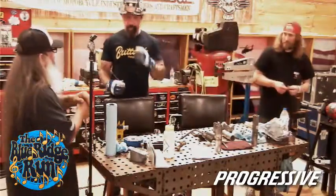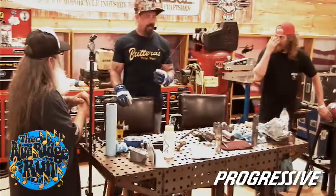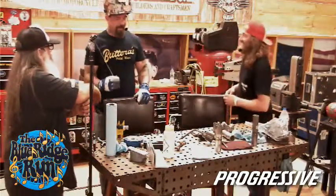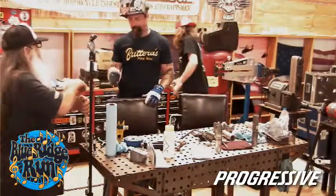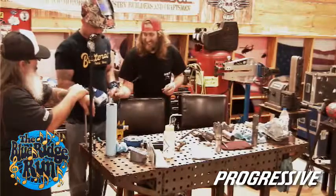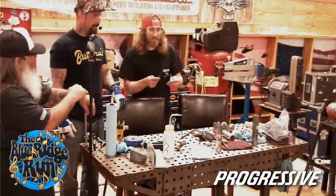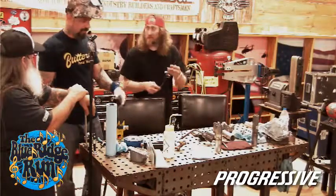One thing when you go to grab your rod, stainless and aluminum rod look real similar. One's a little lighter than the other, but I think we've all grabbed the wrong one. If you don't have it, you'll learn real quick as soon as you arc it up. A way to tell is that aluminum has a lot more spring when you move it. Stainless steel is so much firmer.